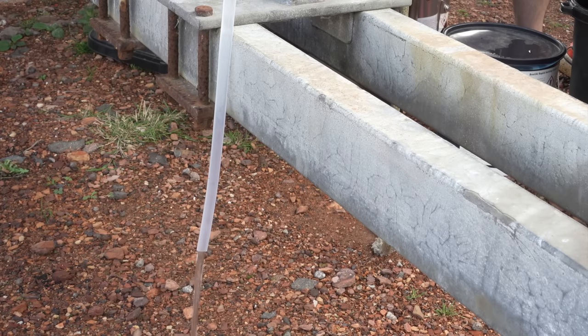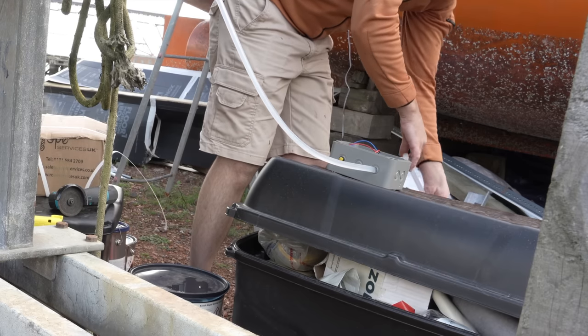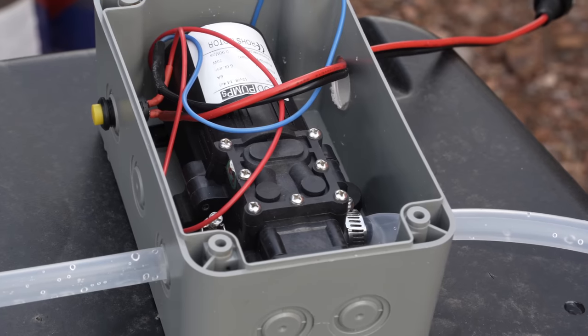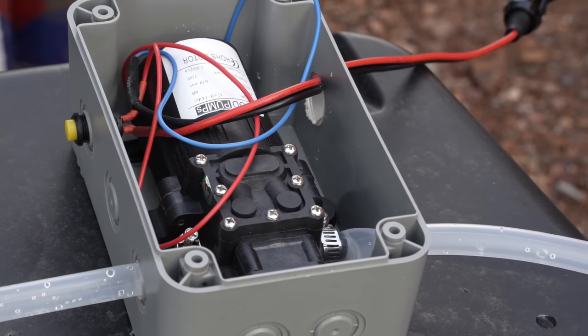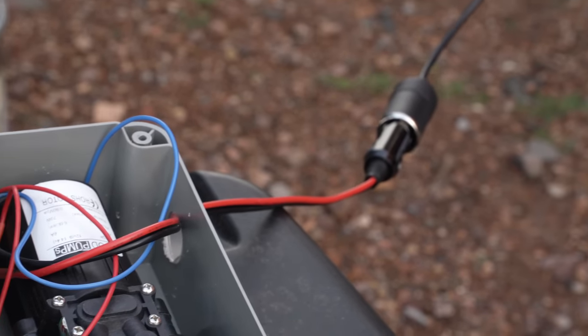To reiterate, this is for emptying out small and sometimes inaccessible mini bilge areas, and not when in a rush. The self-priming works well, and it's effective at pulling the remaining water through and out the end, running the pump to dry, so we don't have dribbles of bilge water as I try and put the pump back into storage. The male 12V plug is to be embedded with putty into that hole, so that it protects all the various components, lacks a messy trailing lead, and I'm free to use my 5-metre plug and socket extension cord when the pump's needed.